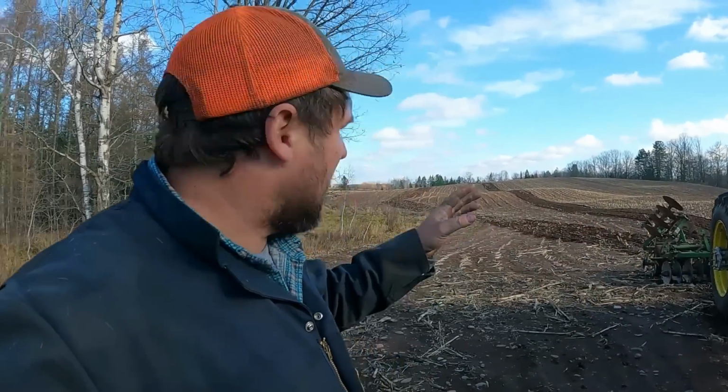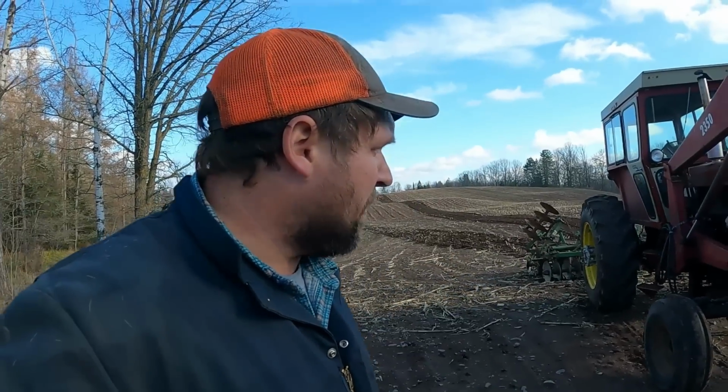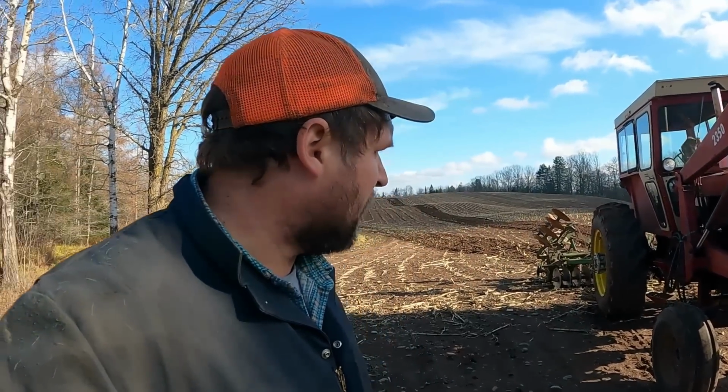And it also seemed like when I get on them hills, it bogged down pretty quick, but it's also not turboed either. So it could just be because I'm more used to disking and stuff with the turbo tractors. Or maybe the governor in that injector pump is a little bit sticky yet. Maybe with some more cleaner running through there, that'll open up. But otherwise it seems to do pretty good.